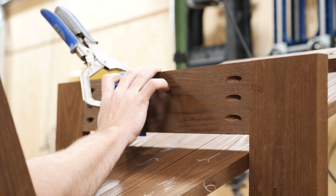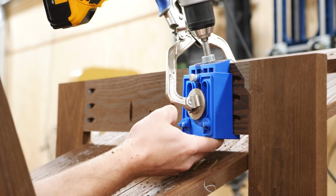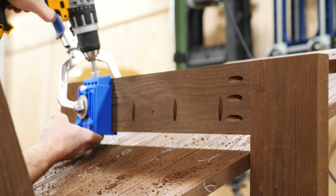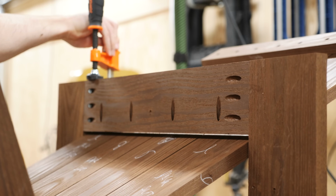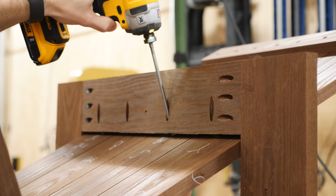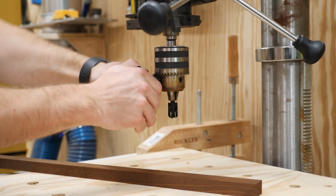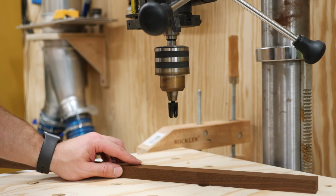While the paint dried, I could finish up the wooden portion of the chair, and now that the base was out of the way, I could add pocket holes to attach the back panel to the back stretcher. And I waited to do this until now so that I didn't have to guess at the location of the pocket holes, as I wanted them to be roughly centered on each back slat to allow for wood movement. After attaching the back panel, the structure of the chair was done, so now I could get everything cleaned up.